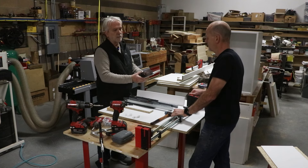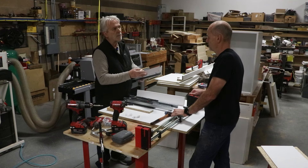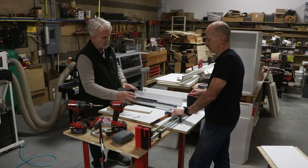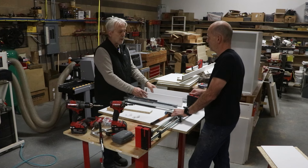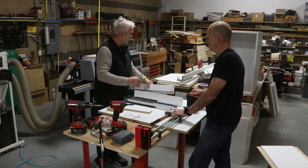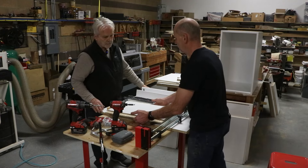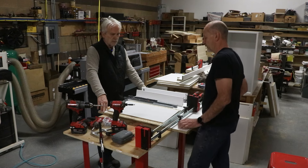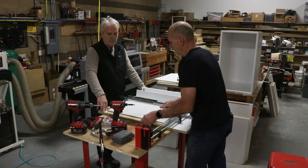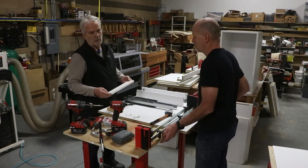This is the Blum Legra box, and there's really been a great effort put into this drawer line. These are the sides of the drawer, along with various hardware that goes with it. With a drawer like this you only need two parts: a bottom and a back. Both are cut on the CNC — the bottom has a rabbet cut and pilot holes, and the back piece also has pilot holes done on the CNC.